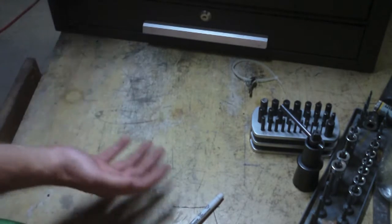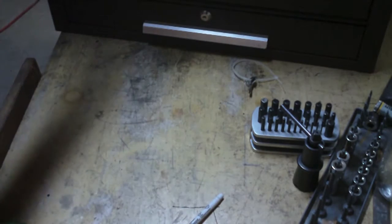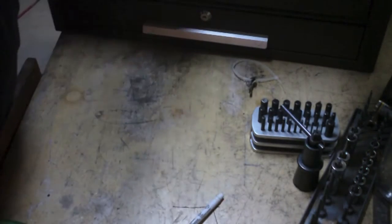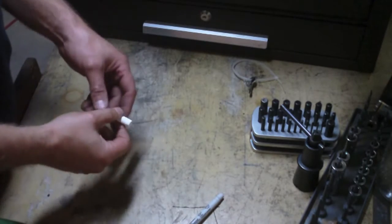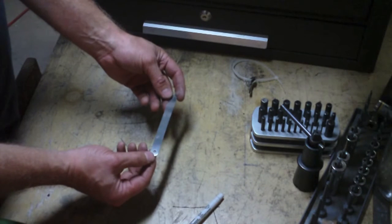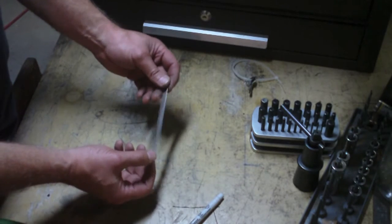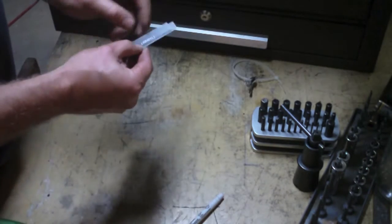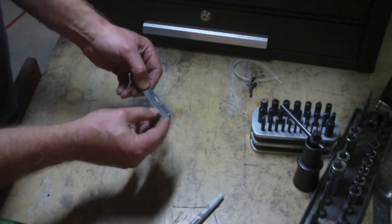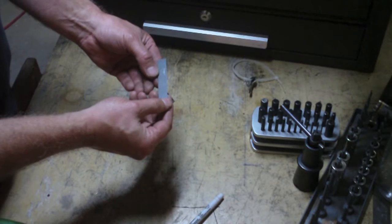I'm going to close this top drawer so the light gets down here a little bit. Next drawer has nothing but a Q-tip. At least it's not used. The middle lock drawer was empty. Top right drawer, ooh, piece of chalk, a long feeler gauge blade. This is a 0.305 millimeter or 12 thousandths precision brand, but it's just a single blade. Here's a couple of little tiny scales that are marked Thin Bit. Thin Bit cutting tools, Kaiser Tool Company.